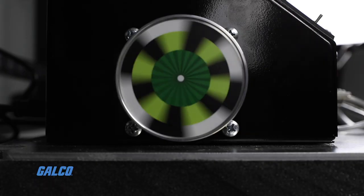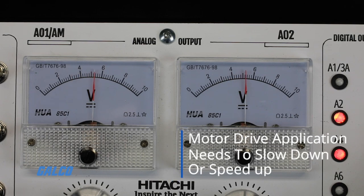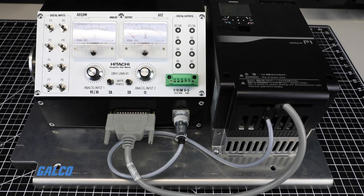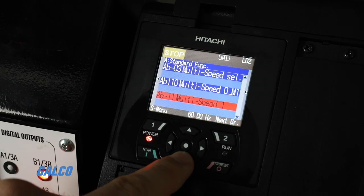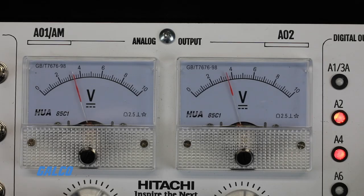This is the type of operation that might occur if the motor drive application needs to slow down or speed up at set intervals. A controller on a timer, for example, can tell the drive to look for the multispeed reference and use that setting for a certain amount of time, then revert back to the default speed reference and repeat.